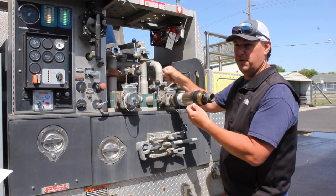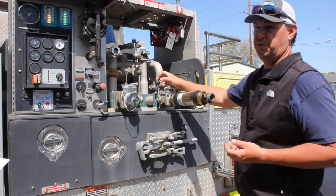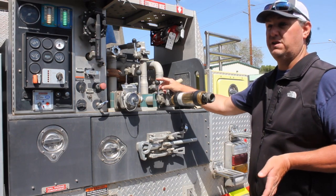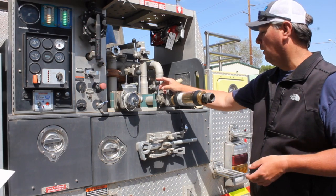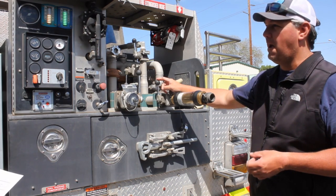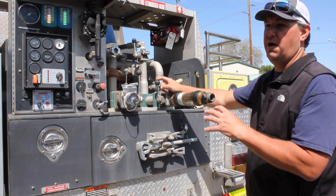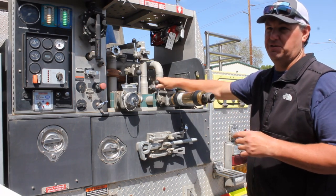Then I crank this up a little bit more until it hits 100, and I do the same thing. Doing a pump test with the flow meter is really easy, it's really convenient, and it works pretty well. The problem with the Darley AGE is that max performance is not at max RPM, so it's not a static point, and I'm only making one adjustment and reading.